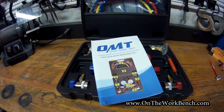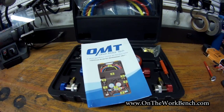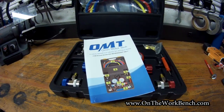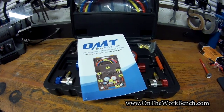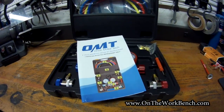What I went with here was a four-way setup where you can have a vacuum and your recharge tank all connected at the same time, and you just have to manipulate the valves to be able to recharge it. Rather than having to quickly move hoses around, I just think that the four-way valve systems are a little bit easier. Not everyone likes them, so I understand some folks may disagree.